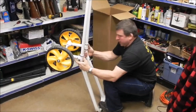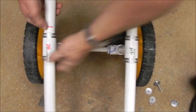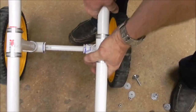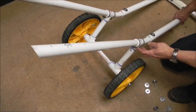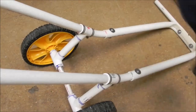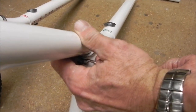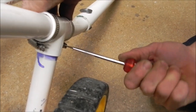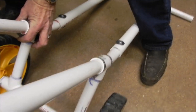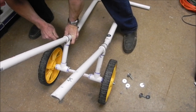Then you stand this up and you slide these down. I've got a couple of marks where they can move to for the pins to work. You can see this mark is right there where you should slide that to, and then this one has a mark here so you can slide to that mark. As you can see, I have some pipe clamps here — that's what you're going to use a screwdriver for. Once you get this in position, you're going to tighten these up so that the pipe clamps give extra support and we won't have to worry about any cracking. It gives extra strength. Tighten that one, come over and tighten this one in place. They're just finger tight when I send them to you so you can slide the pipe over easy, but then you tighten these on.